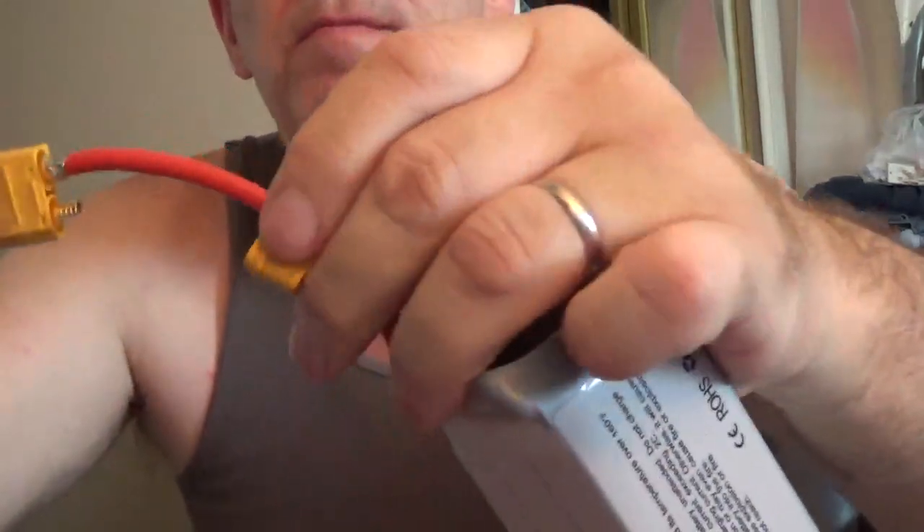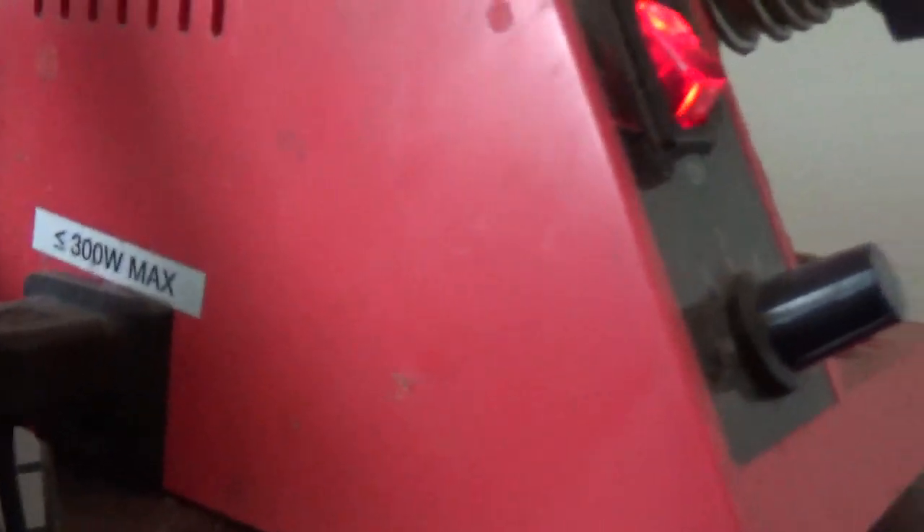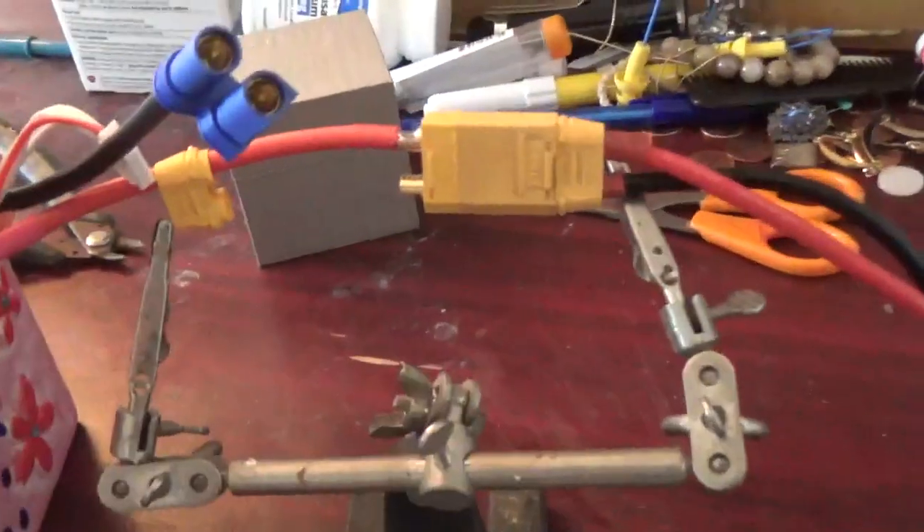Once I put the battery connector on, I'm just snapping the wire back on here - that's it, very simple, just snapping it into place. Hopefully if you have to do this, make sure you get a decent soldering iron because it is extremely important - make sure it has ample wattage, especially for these bigger batteries where you're going to be pulling some amps. That's all I have for now, thank you for watching, happy flying, see you later!